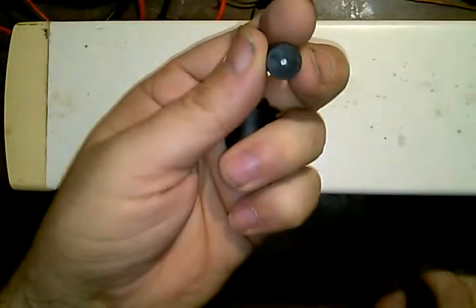It's an older model, it's metal, and it's got two sockets back here. I'm going to add an external battery mod to this. There's the bottom. And I'm also going to be adding a couple of switches. There's going to be this switch here, which is going to turn off the beeper element that I've already taken out of this unit. The reason I took it out is because there really wasn't a way to turn it off easily when the power failed.